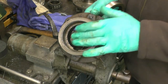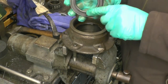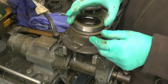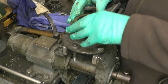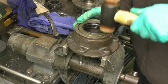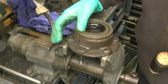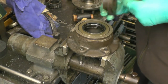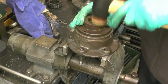This needs to run down to that shoulder there. I don't think I'll have to make a tool to install it. You'll always find that the lip there — you put that towards the oil or grease. This is actually an oil-fed bearing so the oil is in the bearing, goes down through there, and that lip is what seals on the half-shaft to stop the oil running out — or at least slow it down. That level of the face wants to go just below the surface. I've found another chuck back case here which is just the right size — that's going to knock that seal down below the surface.